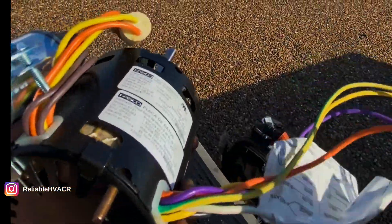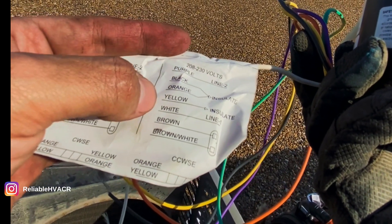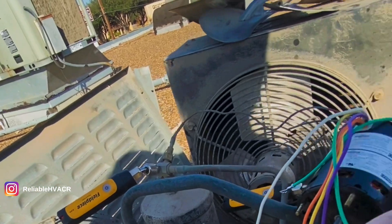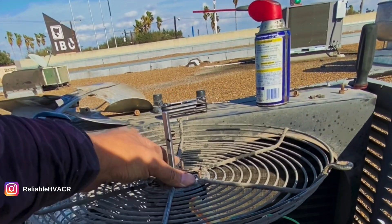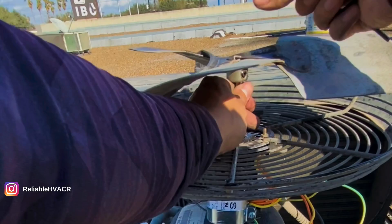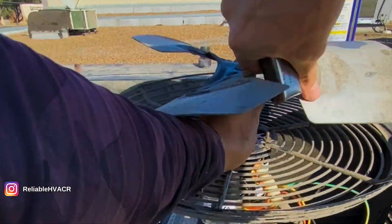We're just getting them going. Wire it up for the voltage and cap everything else — cut whatever you don't need. Make sure you have proper rotation. I like that these are reversible. Make sure you cover and insulate them — don't leave anything exposed; you don't want to short it out or shorten the life of the motor. After this we're going to put it all together and I'll top off the unit just to get them by. This was a weekend call, and as soon as the week comes we'll order and schedule the replacement.